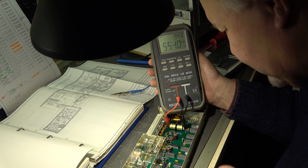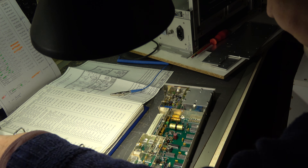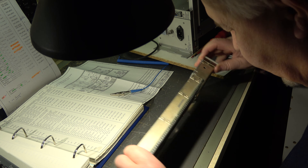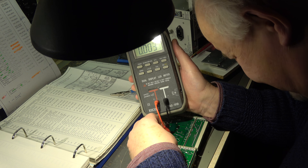We can see: capacity 120, but quality is only 3 — so the quality decreases considerably inside the circuit. The other one I check inside: 100 microfarad, quality 8 — this is also okay. The real quality is much better. This one should have — I don't know — it's the 400... 170 microfarad. Could be C30. What is C30? 470 microfarad. Yes, that's also okay, quality is okay.